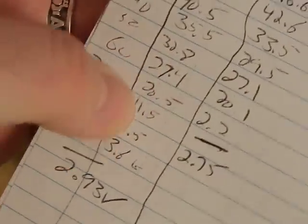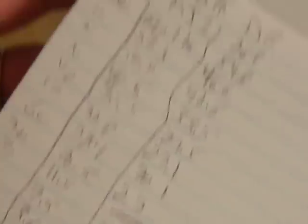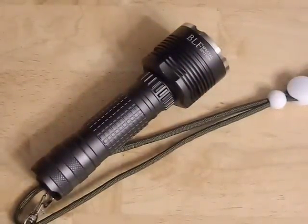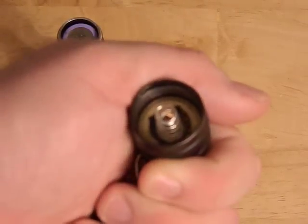A lot of that extra runtime had pretty usable 200-lumen light, so you can get anywhere from 70 to 100 minutes depending on your battery, with brightness staying well above 200 lumens into 70-80 minutes with a good battery. I also did a tail cap reading and on high mode this thing draws 2.25 amps — though your mileage will vary based on your battery and flashlight setup. One thing to note: I did the tail cap mod on this, adding a copper braid to the tail spring to reduce resistance.